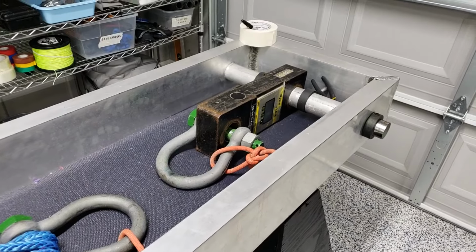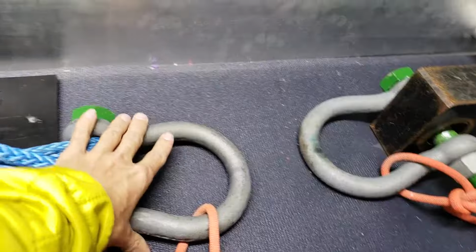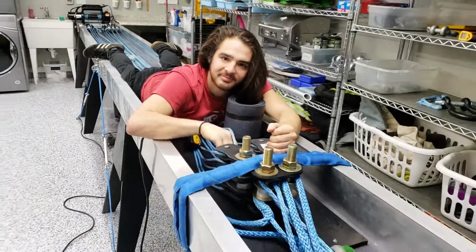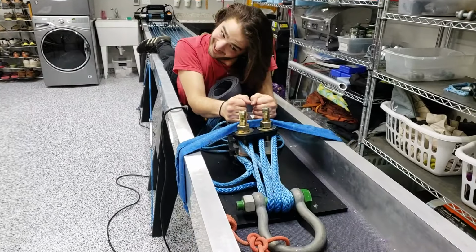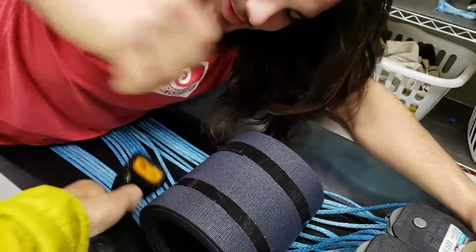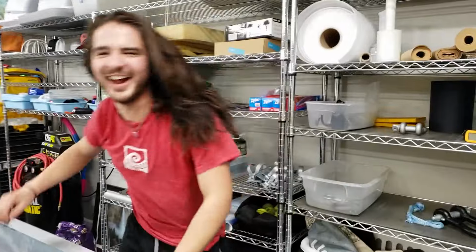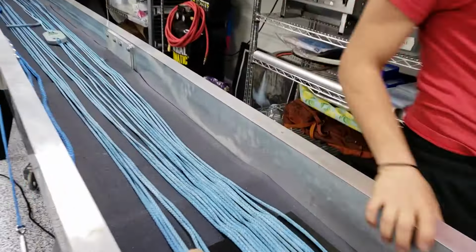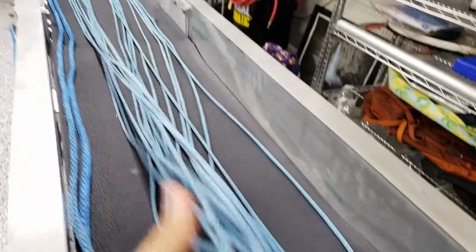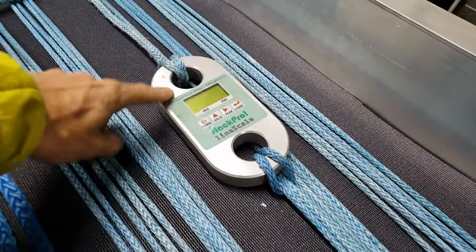So our slackline machine is basically a dynamometer fixed to this side, and then we have this shackle that is attached to this 10 pulley system for our 20-to-1. And Lorenzo apparently doesn't know how this works because he's trying to pull it apart instead of using the button, which is conveniently right here. Which pulls 20 strands of 6mm Dyneema rope, Amsteel. We're using Amsteel to break Amsteel. It's very cannibalistic. We're just curious what the last point is holding.